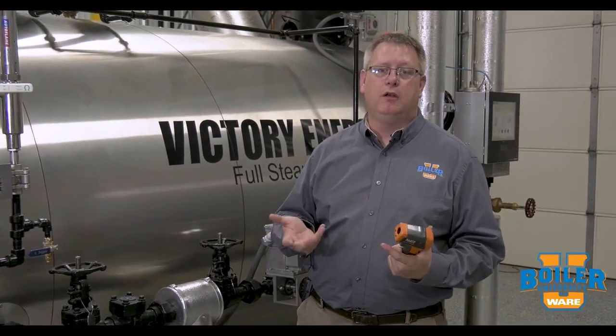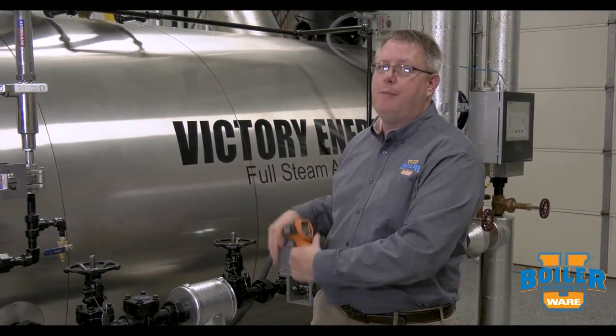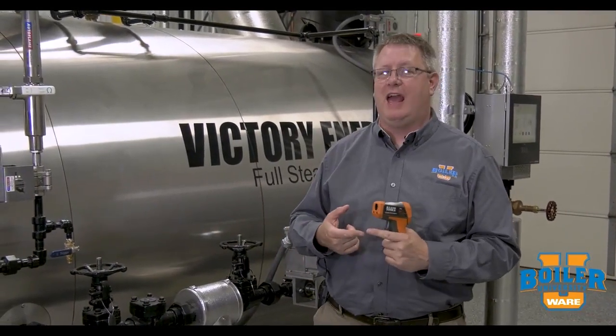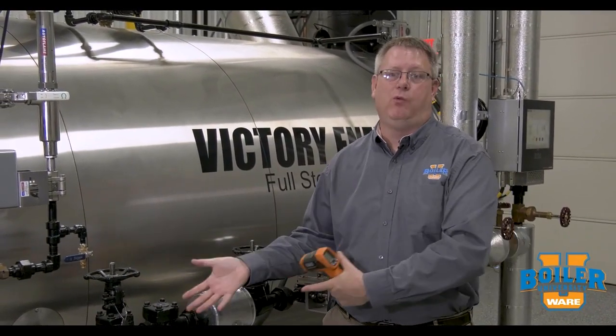And why is that important? It's important because if that superheated water makes it all the way back to our pump, we're going to have cavitation and other issues when we need to add water again.